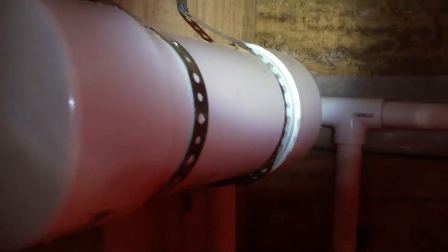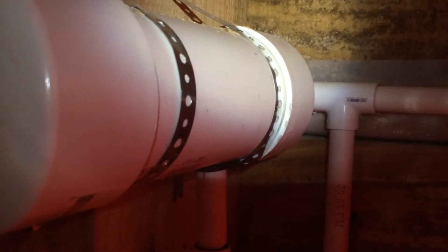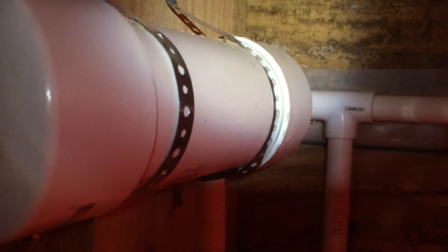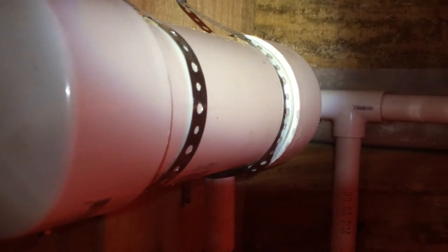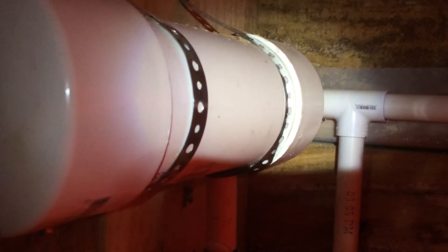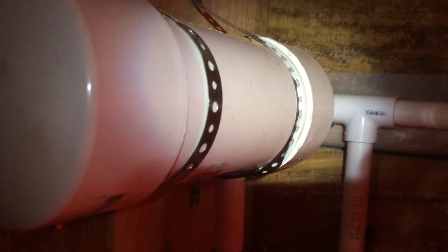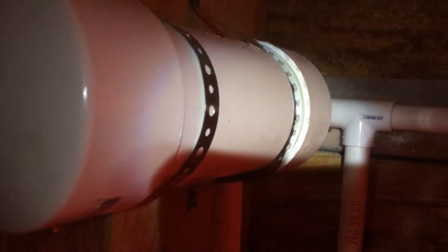Inside I've got what's called a miniature PVC float valve - it was $10 on Amazon and it comes with a half-inch pipe thread. This is key: I tried using a toilet tank valve and you can't do that. It cost me a lot of money, was a big pain in the butt, and I learned the hard way, so take my word for it.